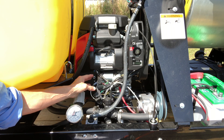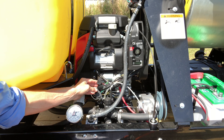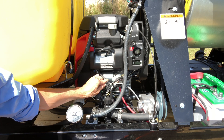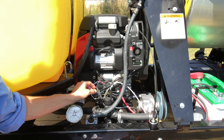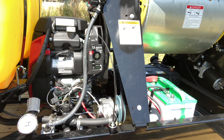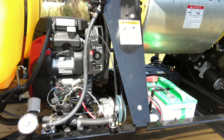There are also some electrical components located right here. It's important to note that there are a few fuses in this area, so during troubleshooting make sure to check these fuses. There's a 30-amp fuse here in this cap, and in here is a 5-amp fuse. Just to the right of these, the battery is located over here — it requires a 12-volt battery. It can be a marine or auto battery; however, the equipment does not come with one, so you'll need to acquire that before you are ready to start the equipment.